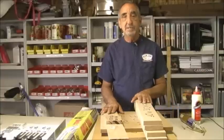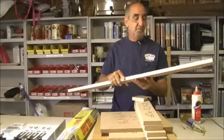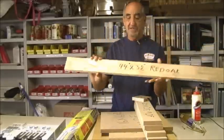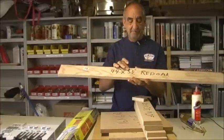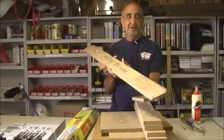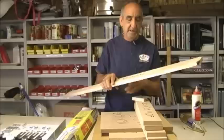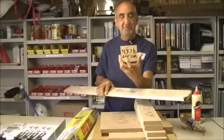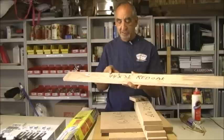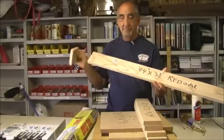The wood you need to buy: the first piece is a piece of red oak. It's three-quarter inch thick, three and a half inches wide. The whole piece is four foot long when you buy it, around ten dollars. It's red oak — it's real hard and it's not going to warp, and I'll explain why that's important later. The piece I cut off the four-foot piece is four inches long. So you're going to cut a piece 44 inches long and one piece four inches long.